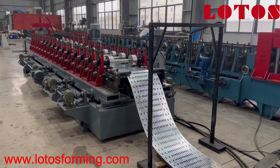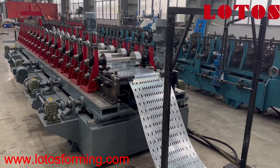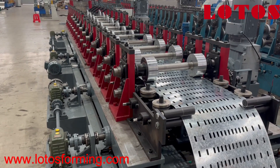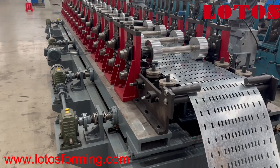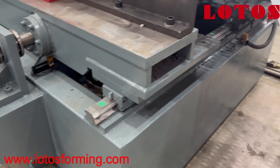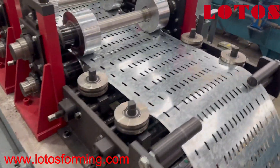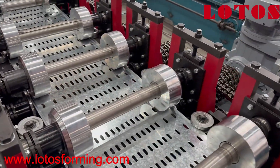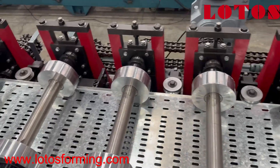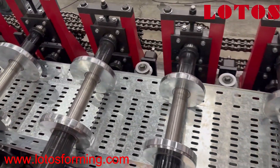As we have suggested, we can make some looper to store the coil material, and the strip then goes through to the forming machine. Since the forming machine must adapt to different widths and heights, this machine is built with automatically adjustable width — the pillar stands move on the rail — and here the sheet goes through to the forming rolling station. We can follow the camera to see how we form the shape.